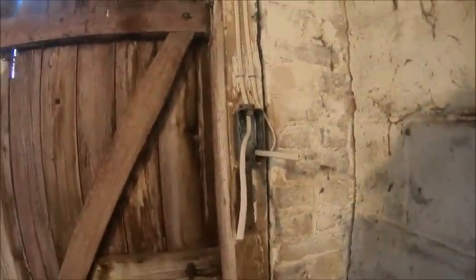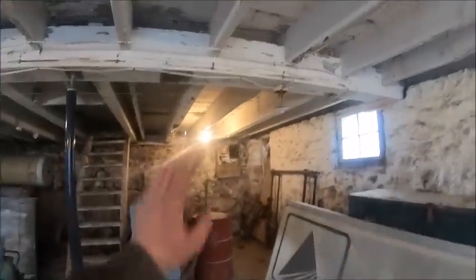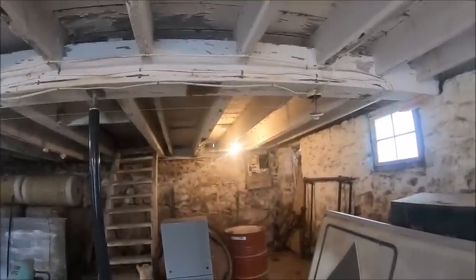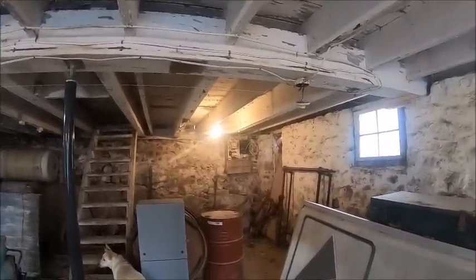And the wire going to the light circuit is run. So now we'll get this switch wired in, and then all of that work will be done, and then we'll have to obviously kill the power so that I can make my connection there, and break that connection there, because we don't want to be working with spicy wires, do we?